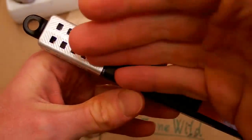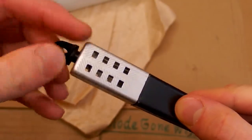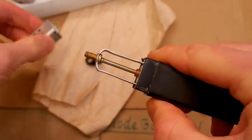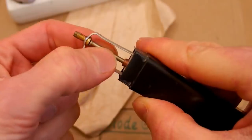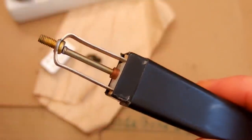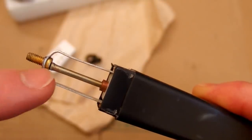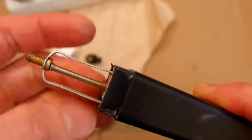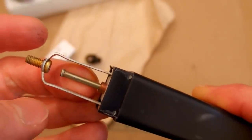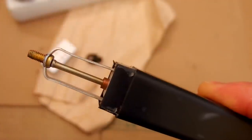Now let's take a look inside, but I don't want to break it because I like it. It seems I can unscrew this and this cover comes off. Here you can see the electrodes. It's a spring-loaded electrode and some coil — an electromagnet. Those contacts are in series with the coil, so when you turn it on it makes contact, the coil pulls the electrode in, then it breaks contact so it goes back, and this repeats — it keeps oscillating and arcing.